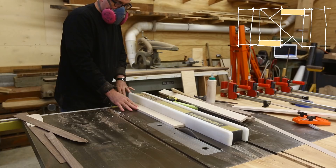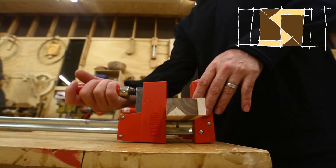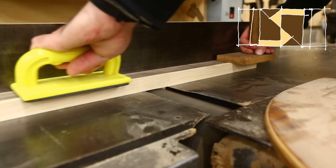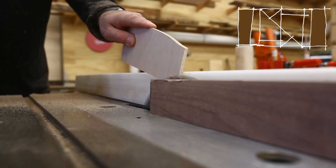That was really the hardest part of the gluing, so I trimmed up the ends. Then I could make the tails on the L, which was an easy clamp to the previous rectangle. You can see how that pattern is coming along. Then I jointed the faces of that piece, because I was going to have to glue it to itself to make a symmetrical pattern. Next I worked on the vertical parts of the L and the walnut spacer between each replicating part of the pattern.